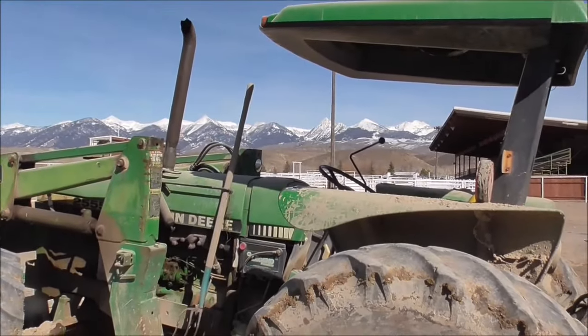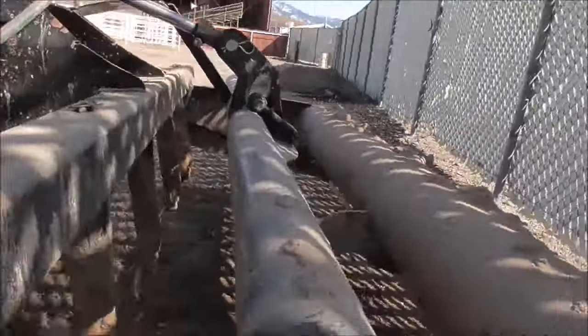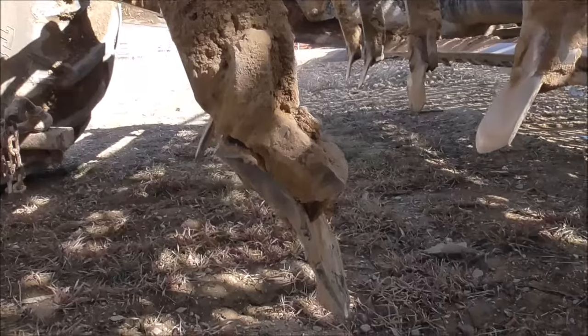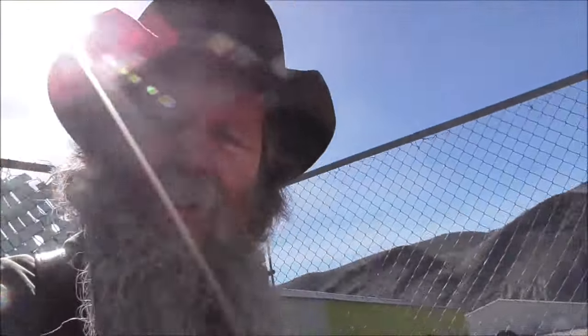Now I've got the arena and the racetrack plowed up. Look at this — talk about poor quality steel. This is what it should look like, and look at this one. Hooked a rock or something and it folded right back. That's half-inch thick steel that bent that badly — it shouldn't do that. Now I get to fix that again: take it off, heat it up, and try to bend it back straight. You can only do that so many times before they start to break. This thing was expensive; you would think it would be a little better steel than that. Anyway, thank you very much for watching, and see you next time.